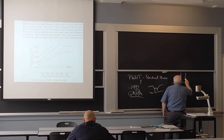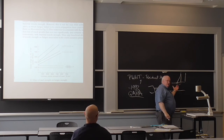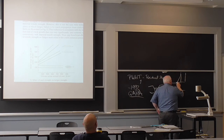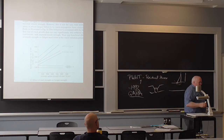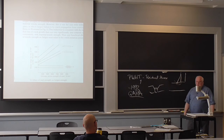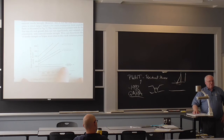I've also got a stress concentration because I have a microstructure in here. The steel in the heat affected zone has different mechanical properties than the steel in the base material because of the heat of the weld. So I have a metallurgical discontinuity, which can create a stress concentration. I'll also have a little bit of slight undercutting, and as the weld solidifies, I can have some little micro cracks, hot shrinkage. Very, very fine, less than a human hair. But when you start combining all these things at the same spot, it doesn't do any good to weld high-strength steel.